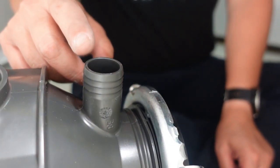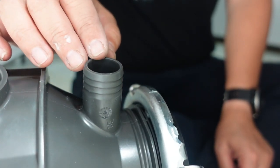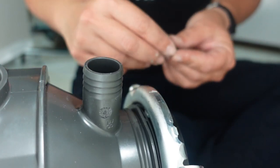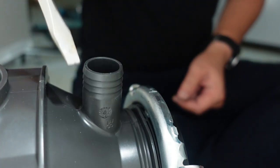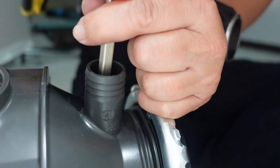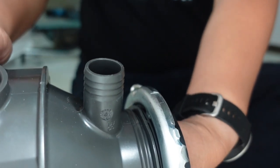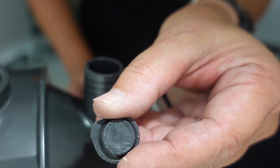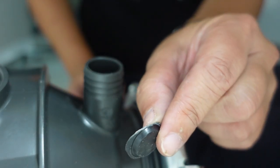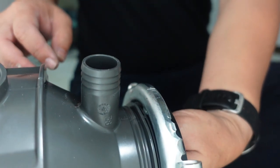This is the hole to the dishwasher pipe. If you don't have a dishwasher, leave it - don't do this. If you have a dishwasher, the pipe goes through here to empty out after washing. Get a flat head screwdriver, put it in, and tap it with a hammer or pliers a couple of times. Then stick your hand in and make sure you get the plastic piece out - it pops out easily. Be sure to check inside for any other missing pieces and throw them away - you don't want them in your new Insinkerator clogging the blades or drain.